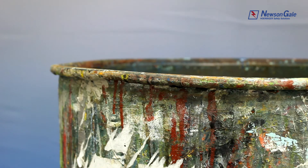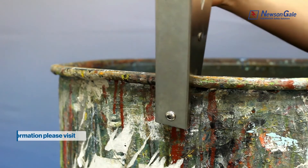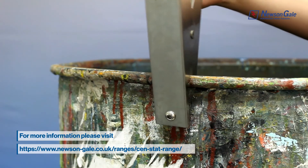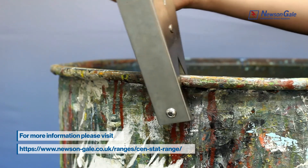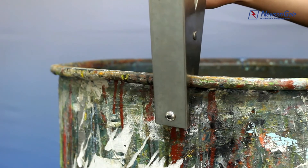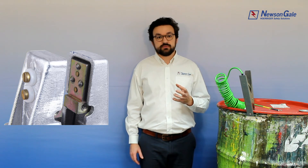On rare occasions, operators may have to move the clamp from side to side to allow the tungsten carbide teeth to bite through the coatings and establish a low resistance connection to the base metal. Unlike stainless steel, where teeth can round and become smooth over time, tungsten carbide is capable of regularly penetrating deposits without a degradation in performance.